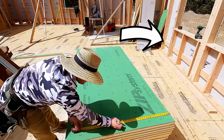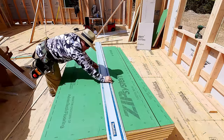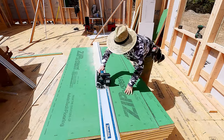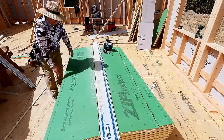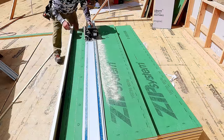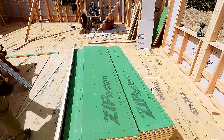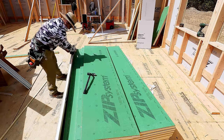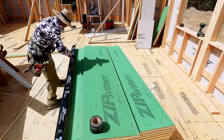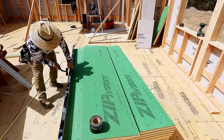Notice on the right-hand side I have a block line that wraps around our entire house — you can see it in the far distance too. That allows us to use two-foot or less pieces from the block line, overlapping our bottom plates and rim and connecting to our mud sill. I like to cut this with a track saw because the straighter our cuts are, the easier it is to use up all of our scrap or waste. Depending on where you're building, you might need to protect that exposed edge of foam on the outside of the mud sill. As I'm cutting my two-foot rips I go ahead and tape those and roll it, then hand them out to the guys who are nailing them in place.